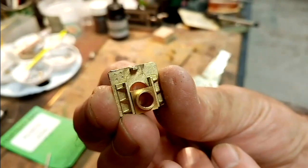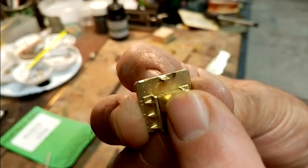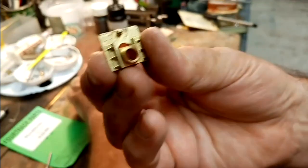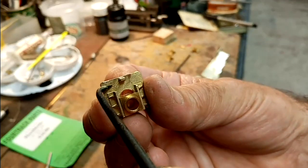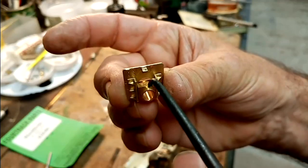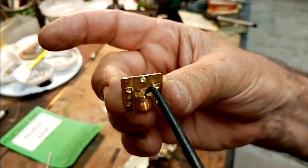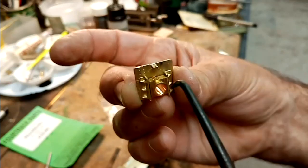So now we've got the axle boxes, all four of them, nice and smoothly sliding up. As you can see from this one, I've popped four little tiny centre pops on it. Those positions there, that's one, two, three, four. And I've also popped four on the top of the axle box itself, you can't really see them very well. So that indicates which way around that goes. If I take them out, that indicates that it has to go back that way nice and smoothly.